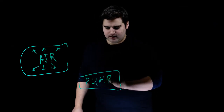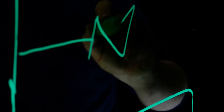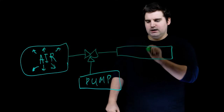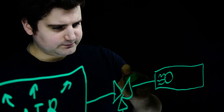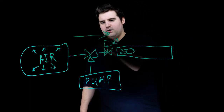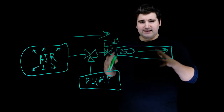I will use a car compressor because I'm a lazy guy and I don't want to pump it by hand. I will connect them by a few fittings which you can find in any hardware store. Here I'll put the nozzle — the nozzle will accelerate my squids and prevent them from falling down on the ground. The last thing I need is a valve with a quick open/close ability. It will quickly release the air from the nozzle so it will take the damping function for the shot. Now let's assemble the pneumatic form.